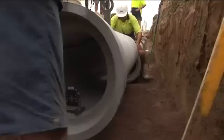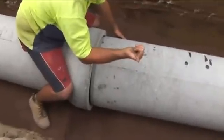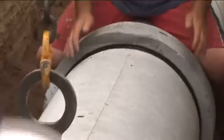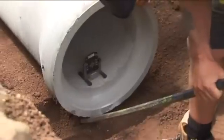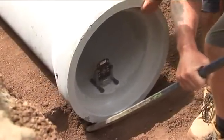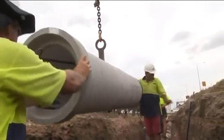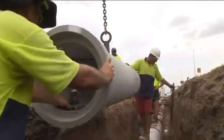When the socketed pipe is placed in the trench, the spigot is offered to the socket with uniform contact for 360 degrees to the socket lead-in. The pipe is then pushed home. This is usually achieved in small to medium diameter pipes by using a bar. Larger diameter pipes are best joined by winching. The key issue is to ensure the jointing effort is applied uniformly and steadily.